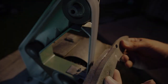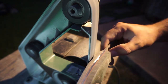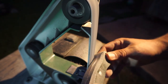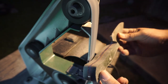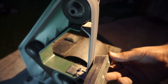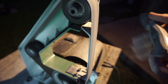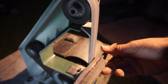We're going to go ahead and put a 45-degree angle all the way around the handle scales so we can start getting a generalized shape. The whole point behind this is once we get the 45 all the way around, I'll be able to put it in my hand and actually start getting an idea of what the next bit of shaping needs to be — how we're going to start contouring. This is me putting it in my hand, seeing where it's sitting and where I need to start doing those contours.